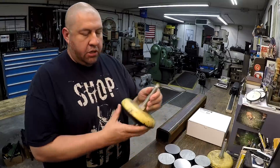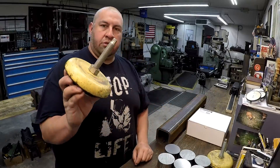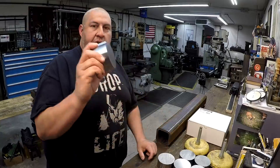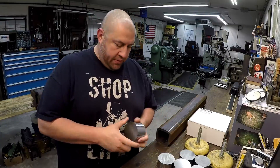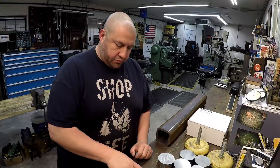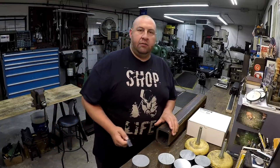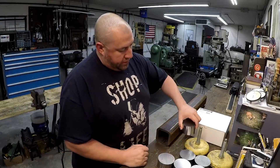I got six of these machinery pads - they've got nice heavy-duty rubber feet to help isolate it and a three-quarter inch thread. What I'm doing is making some solid end inserts that go in the ends of these tubes, then I'll weld them in. I'm using this three-and-a-half inch 1045 chrome plated steel - a scrap hydraulic rod I cut up. I can turn it down to three inches to fit inside this four inch square tubing with a three inch inside diameter, then drill and tap them so the feet can screw up in there.